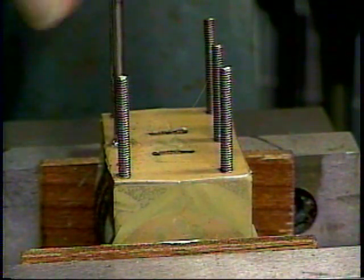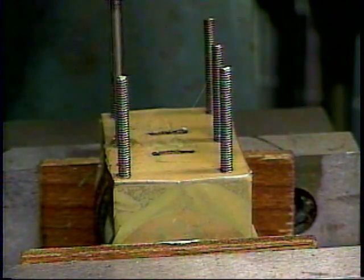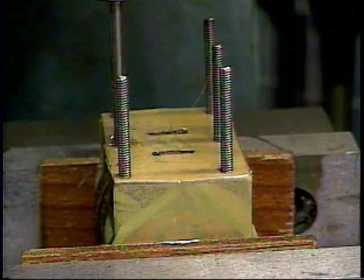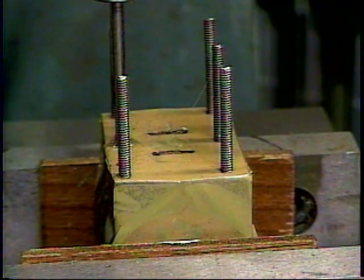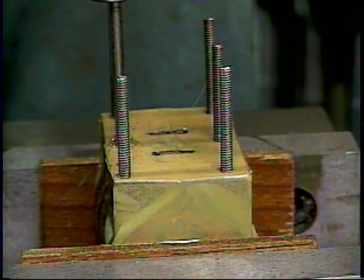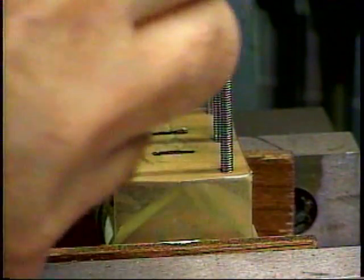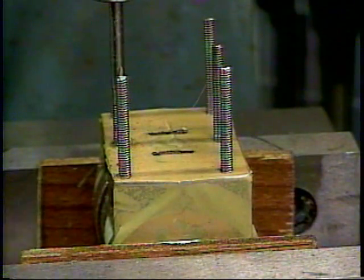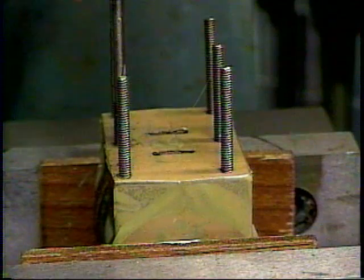And then tap the hole, being very careful to note when I'm at the last couple of threads there, and that's what we're really cutting with the bottoming tap. And I'm going to use the handle, and you can see that's at the bottom there. I can feel that flexing a little bit. So that's the bottom, and we've finished threading the last valve chest mounting hole.